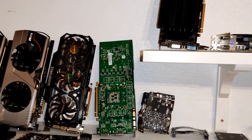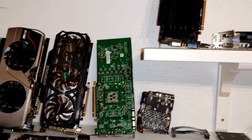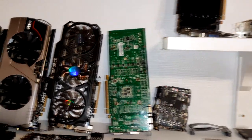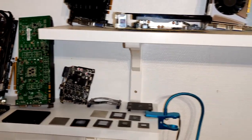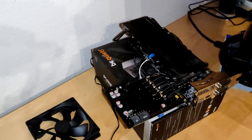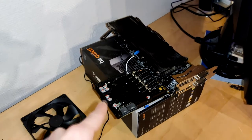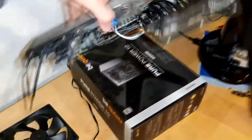That's the card that I just keep as a... I actually considered making an E-Power out of that one as well, because the VRM on these is so weak. If I really want a green PCB one, I guess I can get another one. E-Powering that is still on the table. That's the E-Power that I threw away, don't know why I kept it. Lot of ramblings. Oh, and I completely forgot about this Port 970. That one is going to get its VMEM modded and CAP modded. It's just that the back of the PCB kind of sucks for CAP modding, and that's why I've been putting it off. But it's going to get modded as well, because it's an E-powered card and I want to play with it.